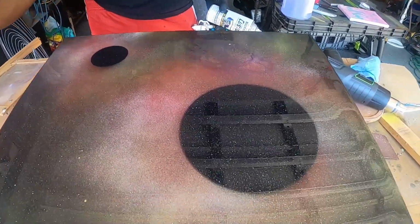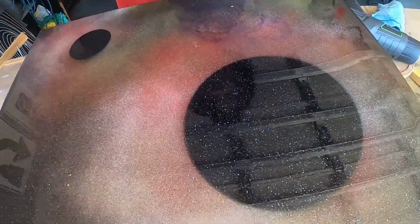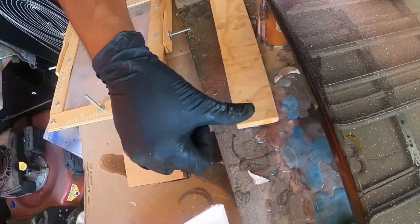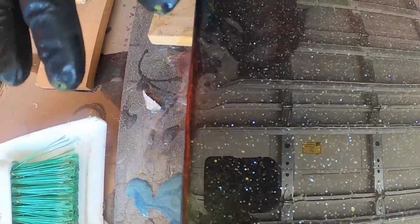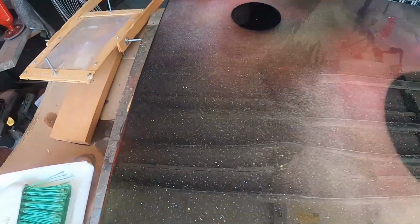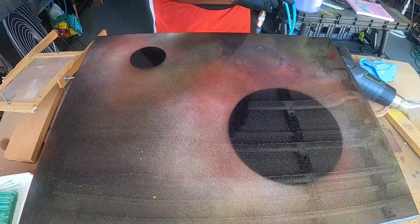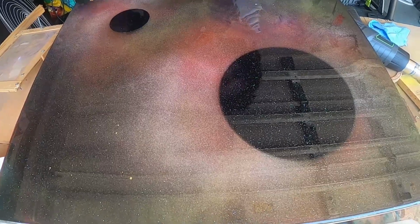And we have our first victim. See, this is exactly why I pour epoxy at night. Can you see him in the camera? We got a fly in the epoxy. Thankfully, it's still wet. He'll never fly again. If this had already started to tack up where it won't self-level anymore, then that would be an issue. But we're good right now. This is why I always pour my epoxy at night, so I can just close the garage door and not have to worry about that.